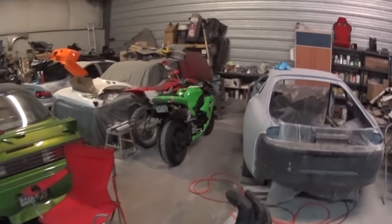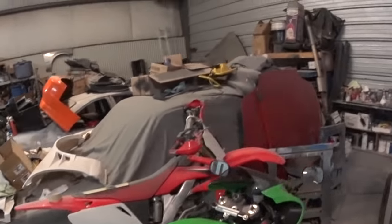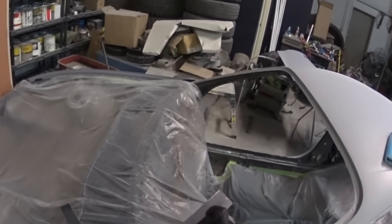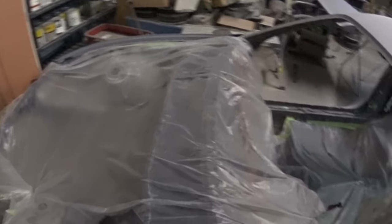This is really fun. That looks like you can make a hood out of that, dude. The SEMA build. SEMA 2K17. I could cut templates with this, because I could just use the snips. That and some cardboard is kind of the plan. So I'm gonna get a piece of cardboard or something along those lines, and basically just cut it with some scissors. I was probably not gonna do this all in one piece, I was gonna do it in multiple pieces. And then we were gonna take a bead roller for the inside of it and run a bead down the center, because when you bend the metal like that, it adds a lot of strength, basically just like a dimple die.